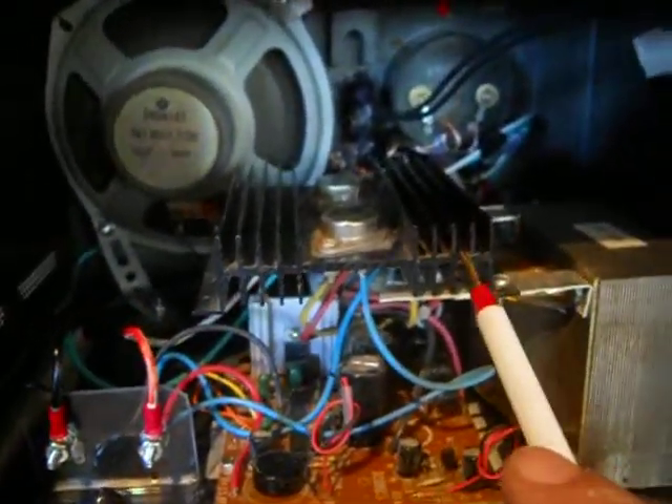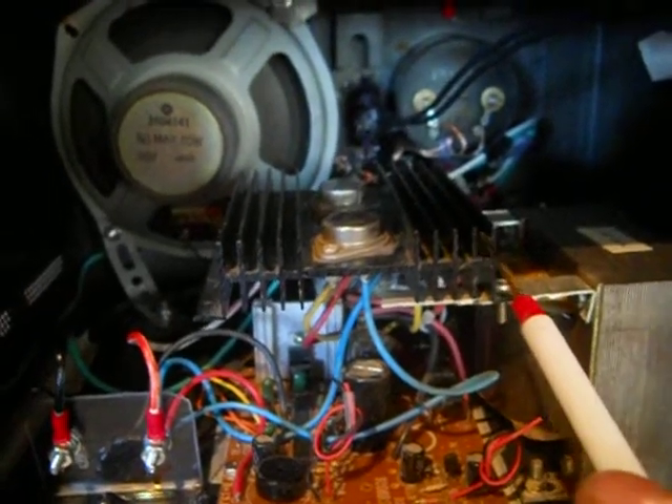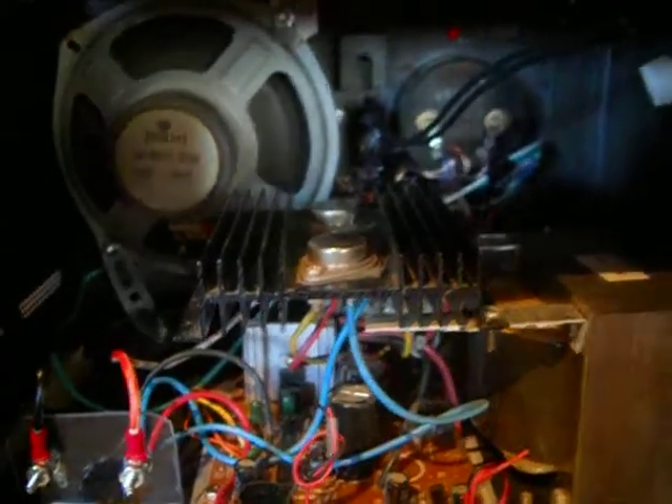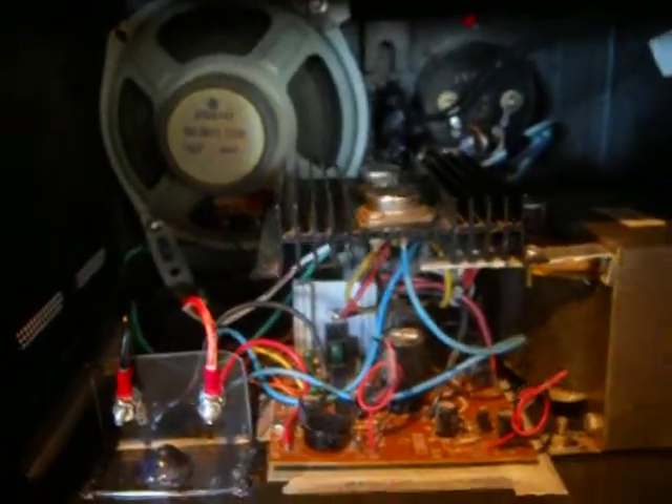This will get warm if you get carried away. I've got a 50-watt 2-meter ham radio — you put it in this 10-amp power supply and it will pull the power supply down. It shouldn't be on this power supply, but I may have to use the radio. I've used it before on it; never worried about it, but it will pull it down. I've actually heard the fan speed go down.